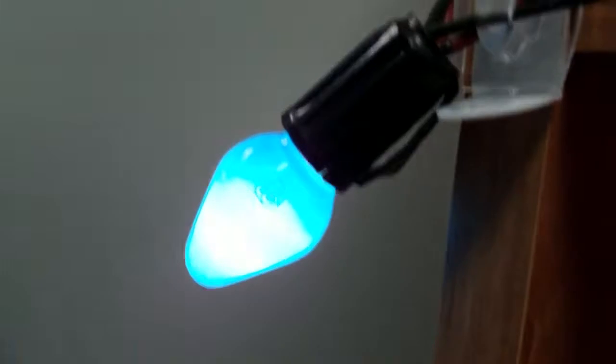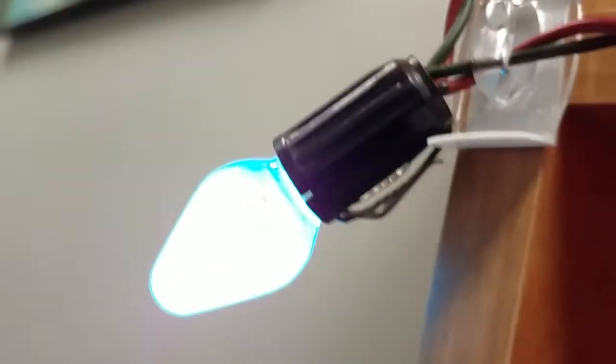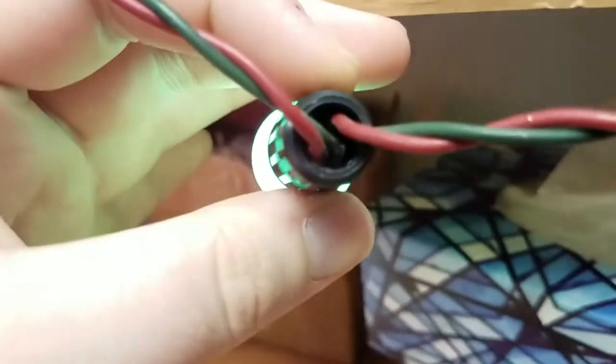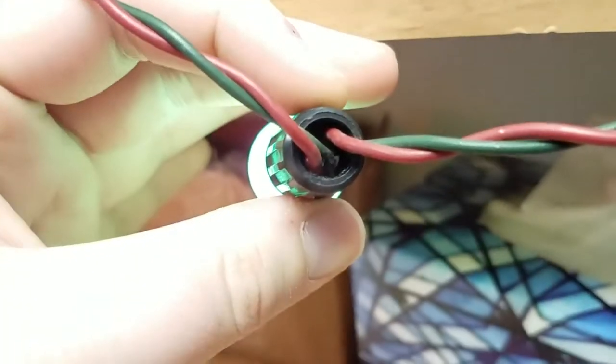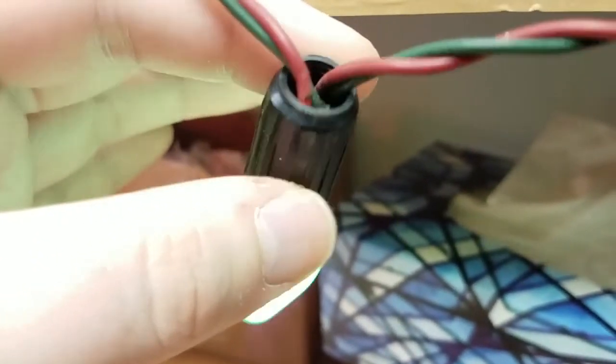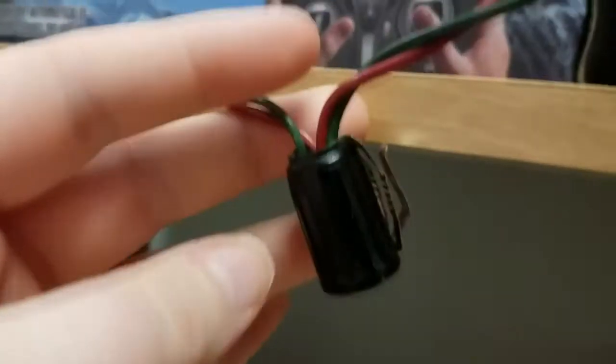I think it cheers the place up a little bit. Now, I do have one bulb, you might be able to see right there, where the Bakelite socket is actually cracked. But I'm comfortable with keeping that socket because unlike a couple of my other mid-century strings, in this string the sockets actually aren't the load-bearing part that keeps the bulb in place. Inside these Bakelite housings is an actual metal socket. The Bakelite is basically just decorative and to cover the metal socket because it's energized, of course.